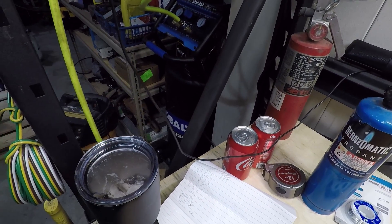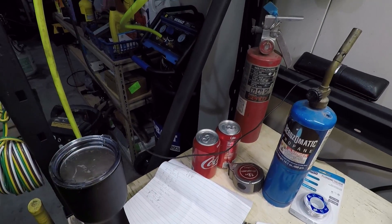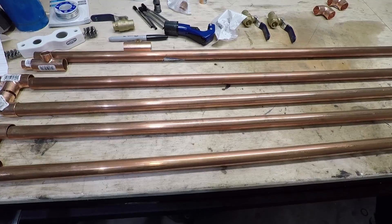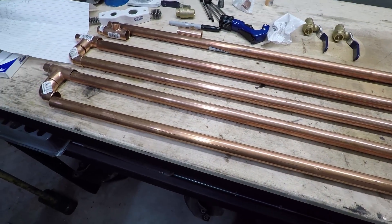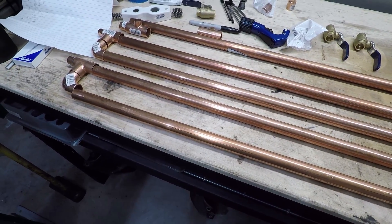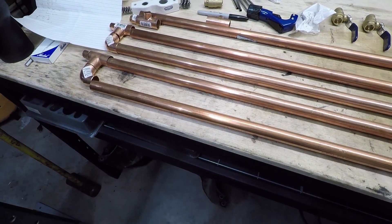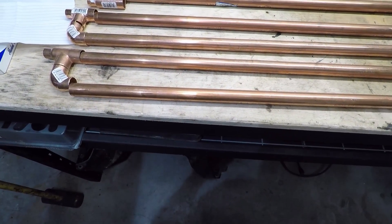It is a pretty quiet compressor for an oil-free, and it doesn't do bad. But it's plumbed just straight into my hose reel and I'm getting water. All compressed air systems have water to deal with at some point. It's from pulling the humidity out of the air and compressing it. It ends up in your tank and then it ends up coming out in your air lines. The air gets hot as it's being compressed, and the moisture stays suspended in the hot air. It goes into your air lines, comes after your tools, starts condensing in your tools, and you end up with water droplets spraying everywhere.